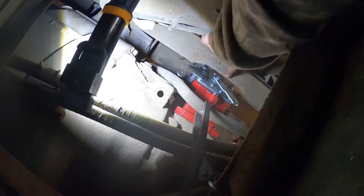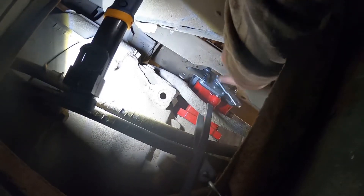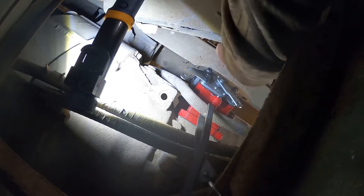Got the arm on with travel set both ways and tightened up. Randy's releasing the porta-power now — watch this clearance get tight. And you can see: you can't put that arm on now without pushing the transmission back over. That's why we have to use a cable-operated PTO — an air-shift PTO will not fit because they have a bigger head and there's just no clearance. I've got the lock tabs bent over on the top bolts and will do a couple on the bottom.